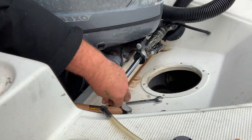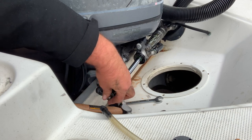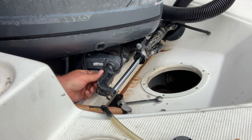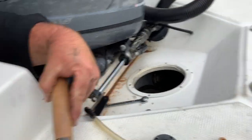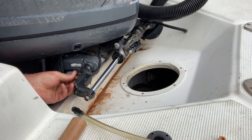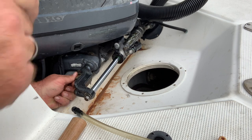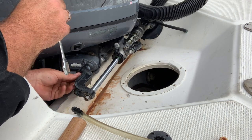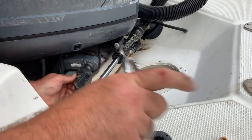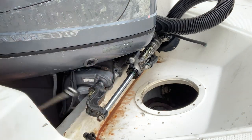So we got the 5/8" bolt here and the 3/4" back here — make sure you've got the right washer. Put the 3/4" on. Got both nuts on there — we're gonna tighten these up and then go do the exact same thing on the other side. A socket would not hurt my feelings right now. Couldn't take it anymore, went and found a ratchet. Just want to get this on there quicker — it's taking forever.